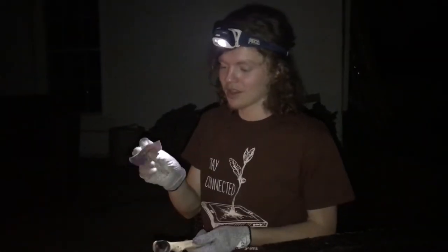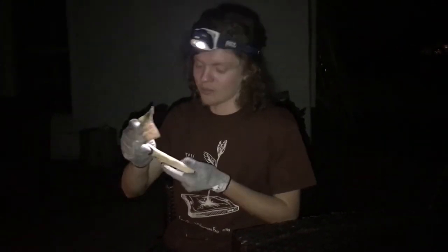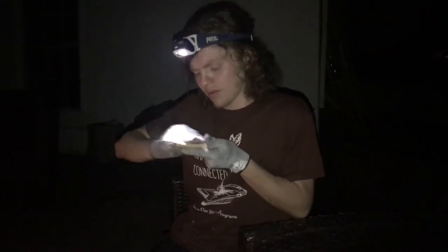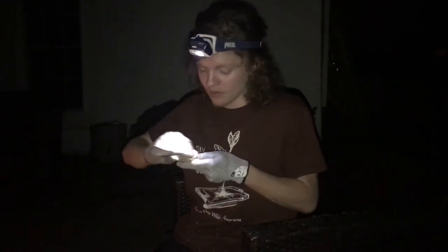I've finished carving my spoon and I have my sandpaper here. This is the rough grit — 150 — and I'll use this to take off the big marks, going all around the handle as well as around the head of the spoon. The spoon is looking nice and smooth after working out a lot of the notches with the 150 grit. Next I'm going to use the 320 grit to take out all the ridges made from the rough sandpaper, and it also brings out the color.